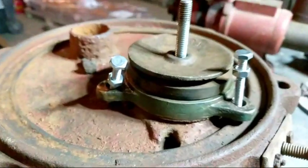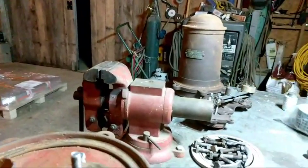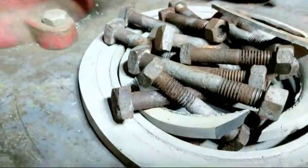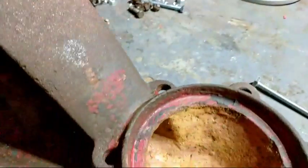So the water that actually gets pumped is pumped in this area, and that's what's underneath that dome. And it's the dome there. So hope you're following me. The waste valve and mechanism for this ram is sitting over here. Again, I have quite the boneyard here of taking this thing apart, and I'm going to put it back in.